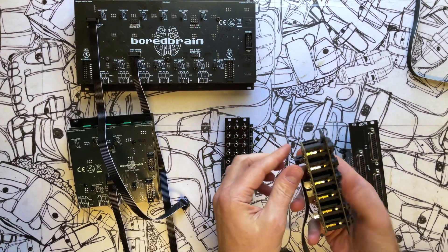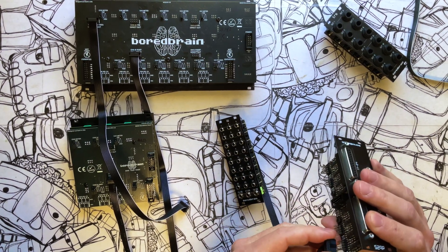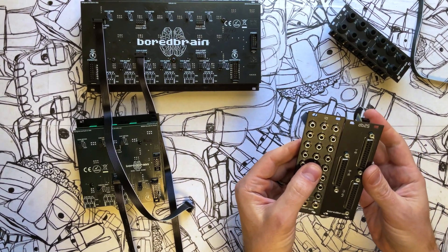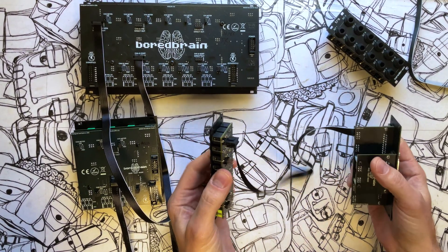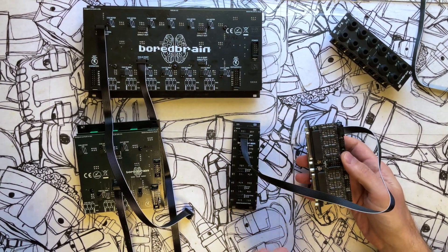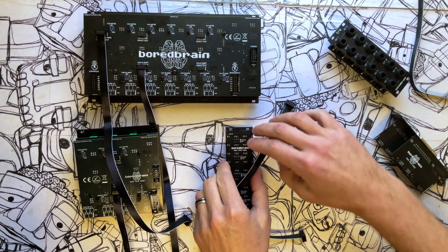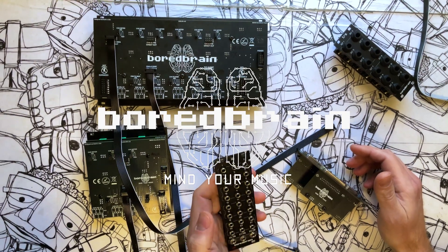You could even use multiple TRS modules. Alternatively, you can use the DB25 and have even more channels - actually connecting the entire IO except for the last stereo jacks to get 24 balanced outputs out of any Eurorack system. So IO can be used as inputs or outputs, and it connects the exact same way it does to the Exelon system using these eight-pin cables, which are included with the output modules. I hope that clears things up for everybody. Thanks for watching and for your interest in our products. If you have any other questions, hit us up on the website or come see us at any of the events we're at.